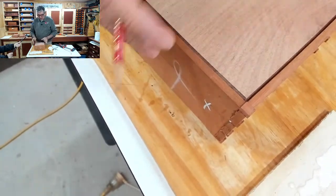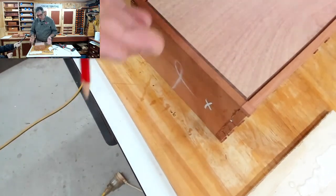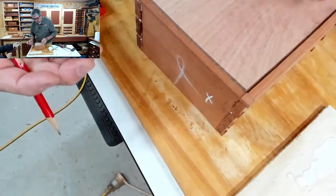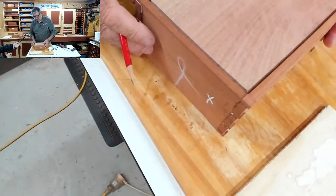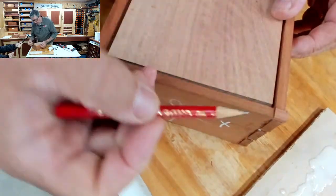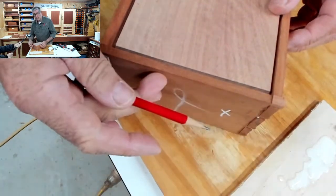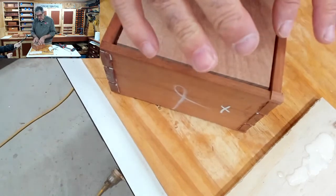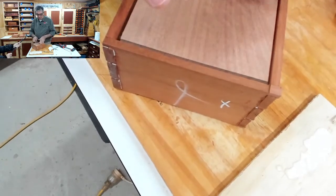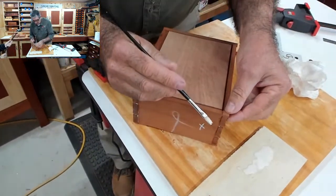Now, normally what I would do with a box like this that we're going to split in half is I should have put the feet in the bottom of it so that it's on the bottom of the box, but I didn't do that. So we have to go with what we've got. And you can see that it's not going to look out of place once that's sanded down to size, and I think I'll use that piece there. You can see that it sits up high, it protrudes out through the end of it, and it's flush with the front edge of the box. So what I've done is I've made the piece bigger than I actually need so that when I sand it down, I can fix up any little errors or any little gaps that might occur during the process. So now it's just a matter of gluing that together.